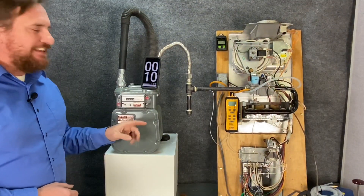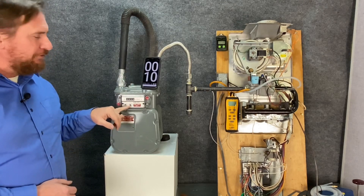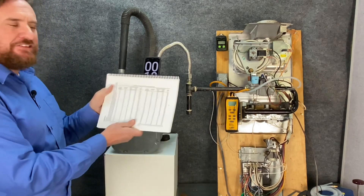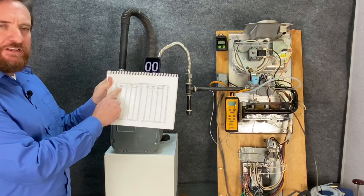It took us 10 seconds to make one revolution. So I've got my stopwatch showing 10 seconds for one revolution of the two cubic foot meter. Now I have this chart here, and what it's telling us is seconds for a revolution — and our minimum is 10.